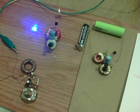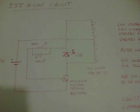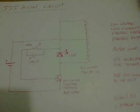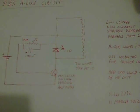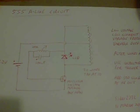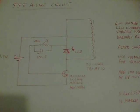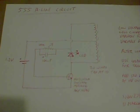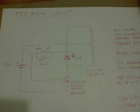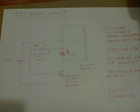That's my little circuit of the day. Low voltage, low current - they only use as much as to get that LED to flash; the rest is storage time building up in the capacitor. Variable frequency by changing the pot position, variable duty cycle by changing the size of the capacitor. You can alter the tap position as well. You can use the collector output of the transistor, which can be any NPN, and that can be a trigger output like you'd use with a 555. Thanks for watching.